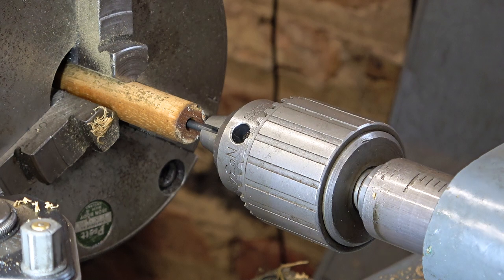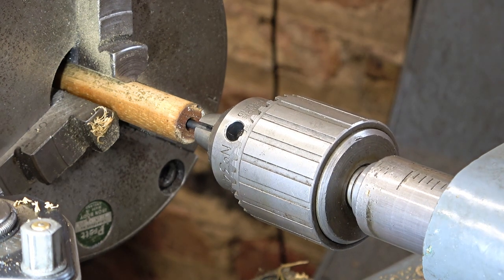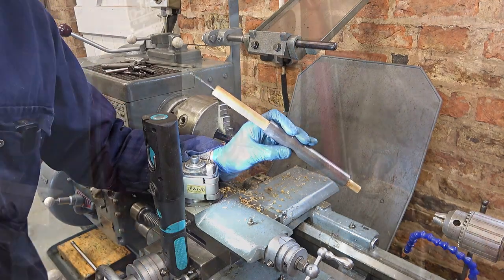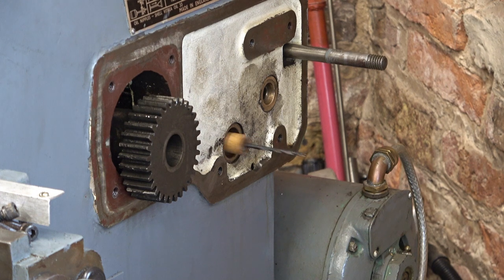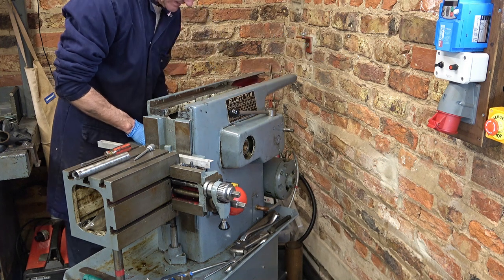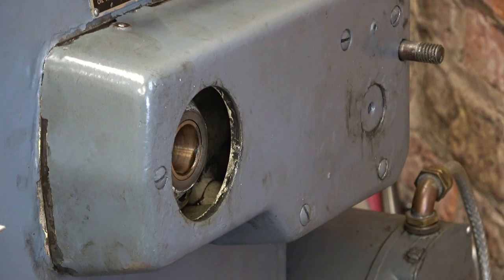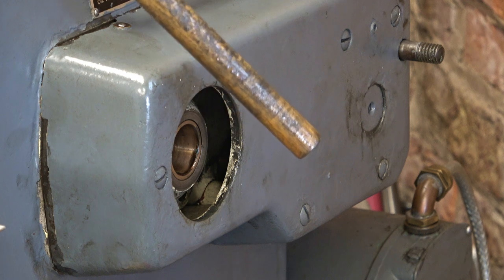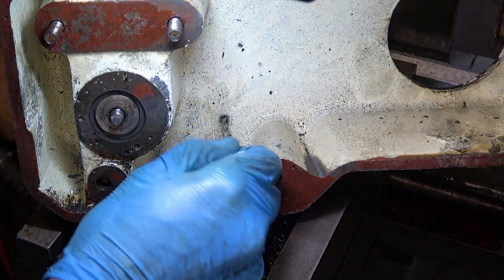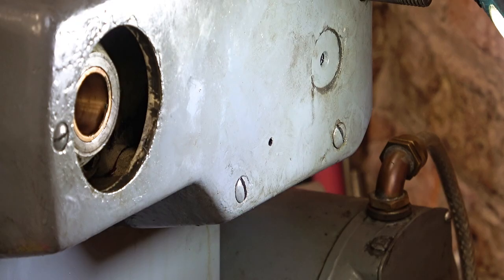The back end of a 3.5mm drill is pushed into a 3mm hole in the wood — which you can do in wood. We're ready to try it; that's the complete unit. Here goes — I'm just hoping the drill won't run off when it hits the back of the casting, being a small drill. Well, we've lost the drill off the end but it must be almost through. There's the drill. Best I can tell it's coming in and out of that hole without any deflection — looking through with a light it appears straight, so that's fine as a pilot hole.